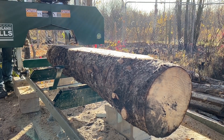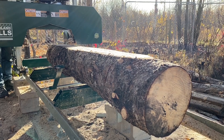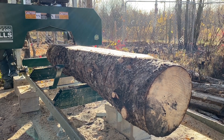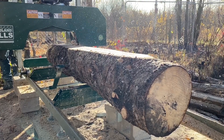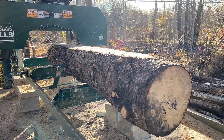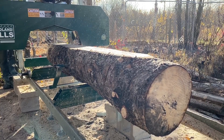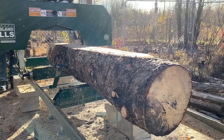An important thing to mention is your log choices for your sawmill. Generally speaking, the best type of wood is to cut green, that way you know there aren't going to be any bug holes in it. The only thing is, when you cut trees down green, ideally you want to be cutting them in the winter — the sap isn't running through the trees then, so there will be less sap in your lumber and it will take less time to dry out.